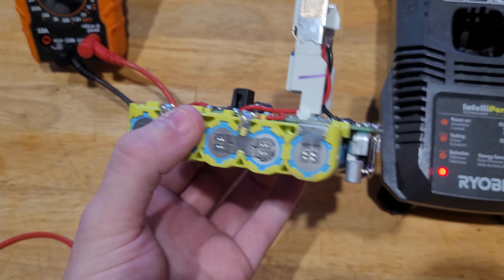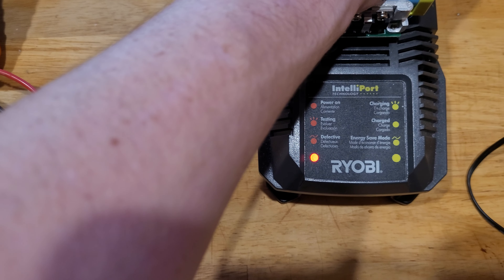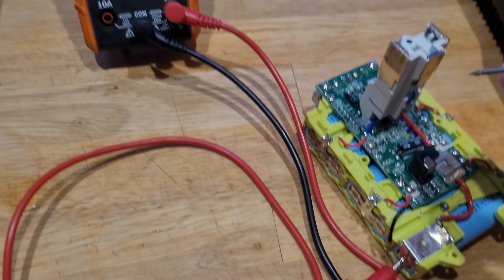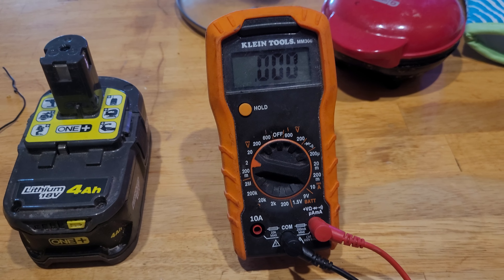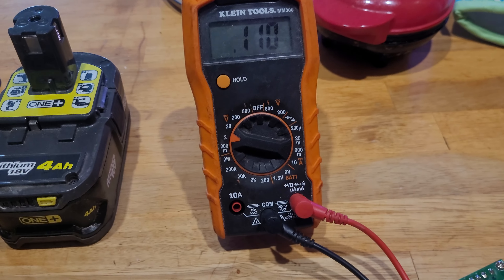Now I take this one — this one's obviously missing its outer shell. I'm going to plug him in, and all we get is blinking red. What that's telling me is that this battery is too low to charge. With lithium-ion batteries like these, you don't really want to let them drop completely down because the batteries will suffer a little bit of damage. But I'm going to show you a quick tip on how to revive them. Just to show you this battery is in fact dead, I'm on a 2-volt scale right now — and that's how much voltage you're getting. Definitely not enough to make this smart charger work.